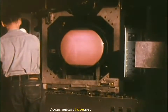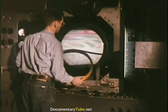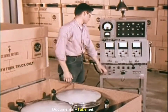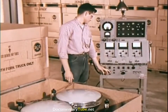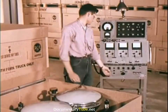Every completed tube receives a 100% performance inspection, followed by the life testing of representative samples. These checks reveal consistently a life expectancy equal to that of black and white kinescopes. Prior to shipment, quality checks are made after a 3-day waiting period in shipping pack. All 3 guns are tested electrically, and an entire lot retested if deficiencies are revealed.